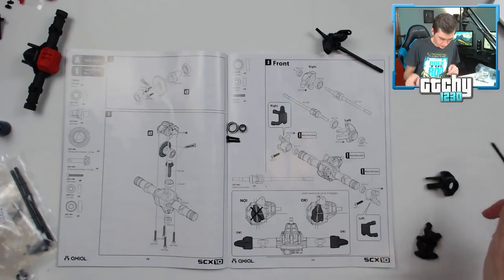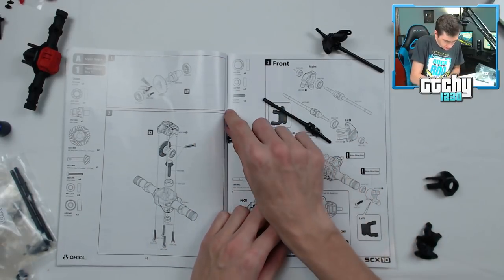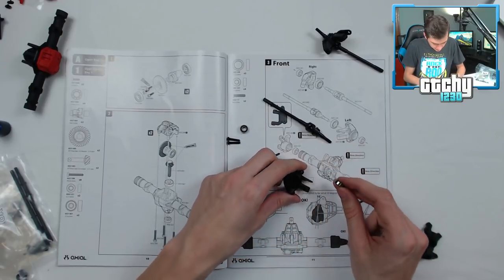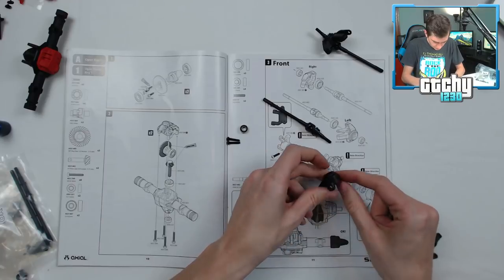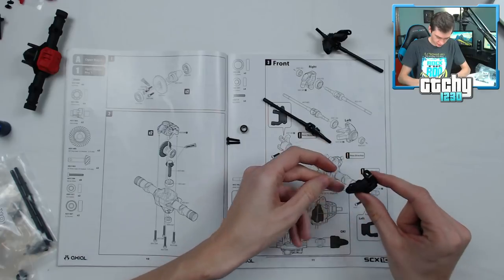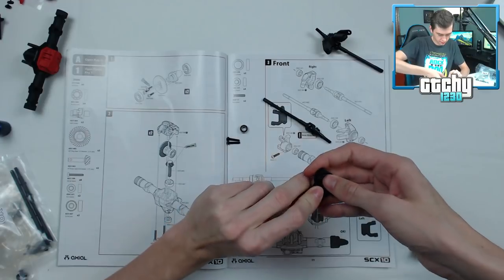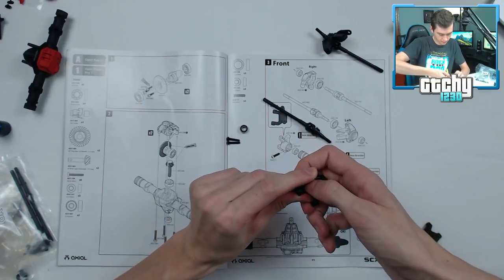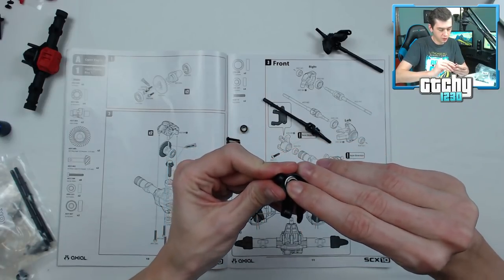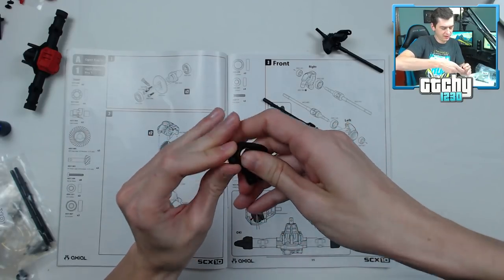And then we're going to pick up our next shaft here, do what we did last time, orient it all properly, grab our 1230 washer. Instead of putting it on the shaft first, let's drop it into place onto this piece. So this goes like this, this washer goes right in here. Come on now. It's gotta fall straight in. If it's falling in crooked at all, it'll be too wide to fit. So it's kind of tough to try to drop it in completely level.